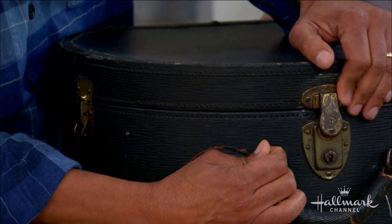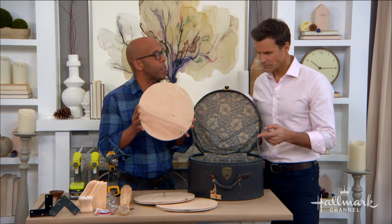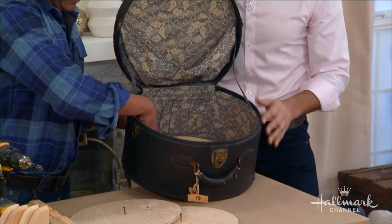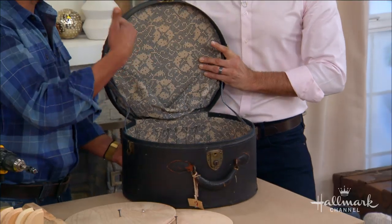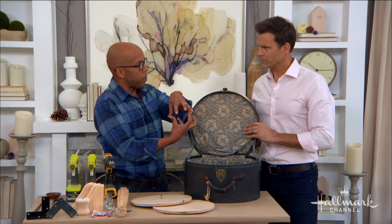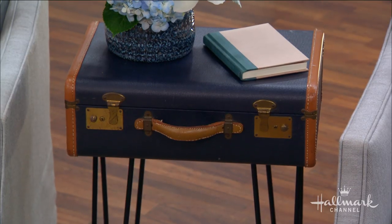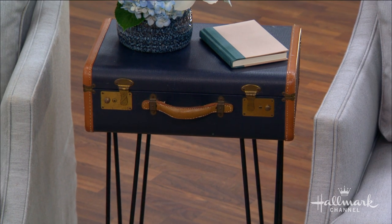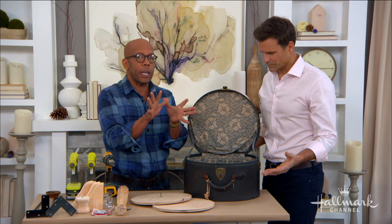These things have been around the world multiple times. What you want to do is just cut a piece of plywood — I find a half-inch works best — that is going to fit the inside. It doesn't have to be a perfectly snug fit, but big enough to cover where your legs are. This is what we're actually attaching all of the structure to; we're going to sandwich the suitcase in between. Because if you put a screw through the suitcase itself, it's going to pop through — the head's not going to be enough, it's going to come apart. This will make it super, super steady.